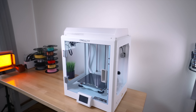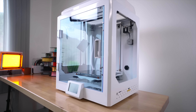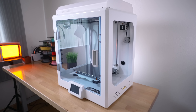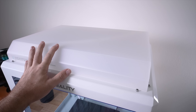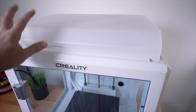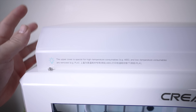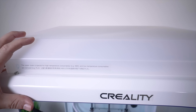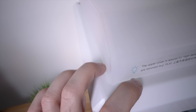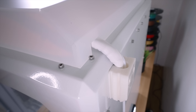Let's take a closer look — it's actually quite large and takes up quite a bit of room. It's a very good-looking printer in white with slightly bluish tinted doors. On top we can see this new cover which helps keep the heat in. There's a note saying that when printing low-temperature filament like PLA, you want to take this off, but with ABS put it on to keep heat inside. The lid sits on the frame between the bolts on four corners, with a cutout in the back for wiring and PTFE tubing.